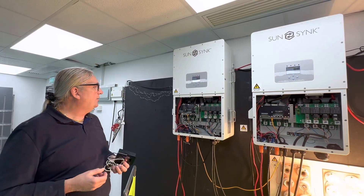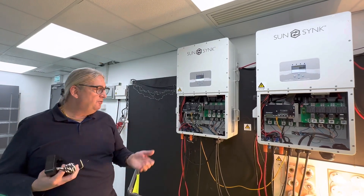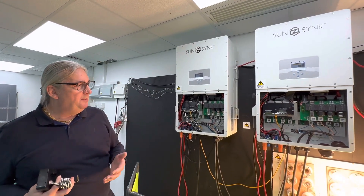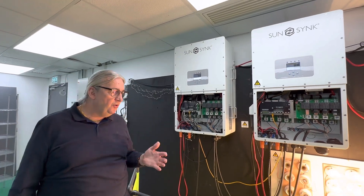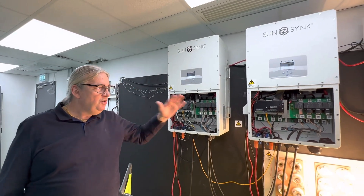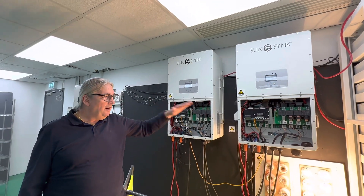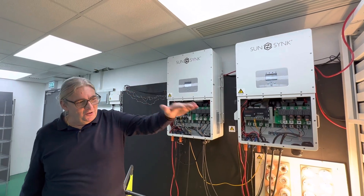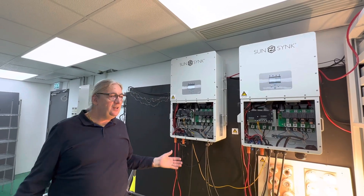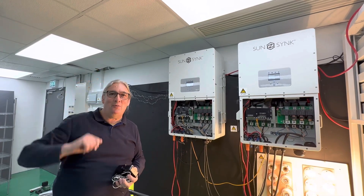There are lots of other things going on with the inverter — it's really, really nice. I'll go through more training including the MPPT and everything else. But the most important thing today was to prove that these two units — high voltage 50 kilowatt inverters — wired together in parallel at 100 kilowatt with 120 kilowatt of batteries, it works. It works amazingly. Thanks for following us and I'll put more out next week.